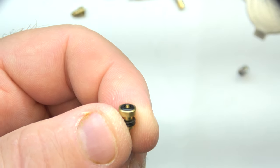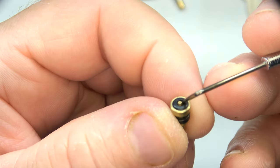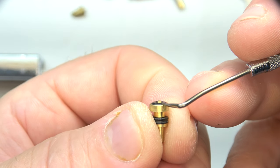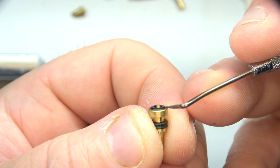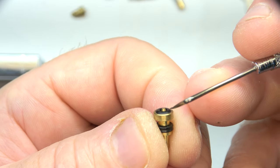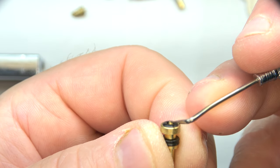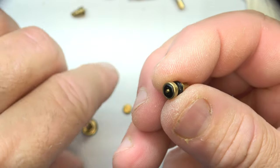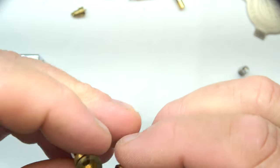What I had done on my lighters — and I may not have clarified this in my videos, that's why I'm doing it now — I've taken this little seal out right here on top and trimmed it down on the bottom side, maybe half, to give you a little bit more room. Just trim it down a little by little, shave it down however you want to do it, until it starts allowing enough butane in and the pin is poking up a little further to give you just enough room to fill it up.